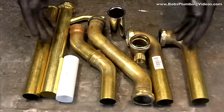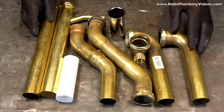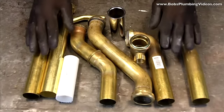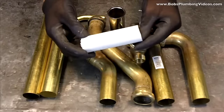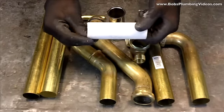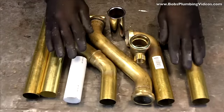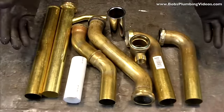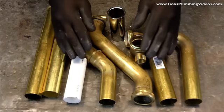Typically how you do that is through the use of waste tubing. Waste tubing comes in many flavors — what you see here is tubular brass. It does come in PVC, which is very nice because PVC is forever. But most of the time I personally use the brass tubing. I've been doing it this way most of my life.